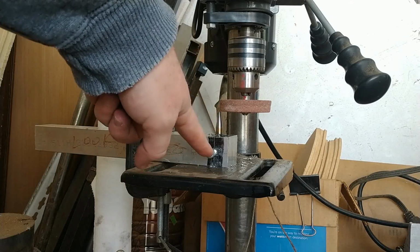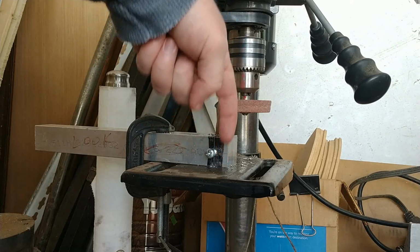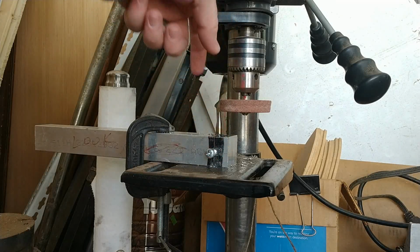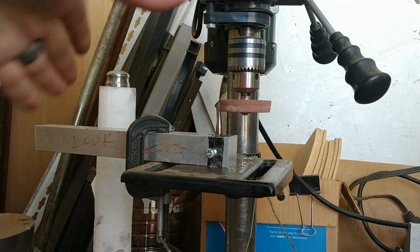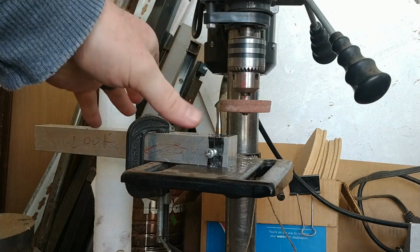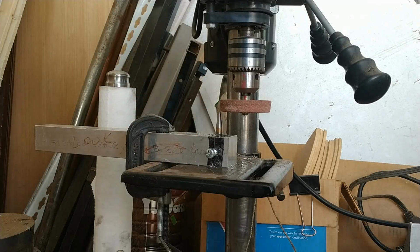So because I clamped it in and drilled this hole the same diameter as the shank, such that it intersects with this hole, this will be as close to true to the actual cutter, the axis of this rotation, as is possible to maintain. I do have to pivot it offset, and that could theoretically change it. There's also inherent flex in every part of the machine.